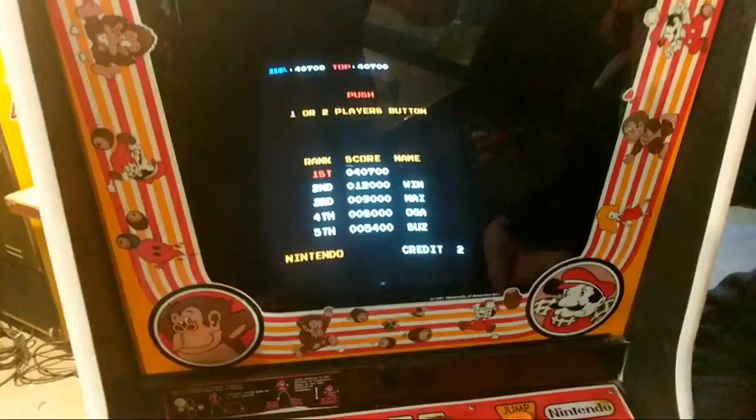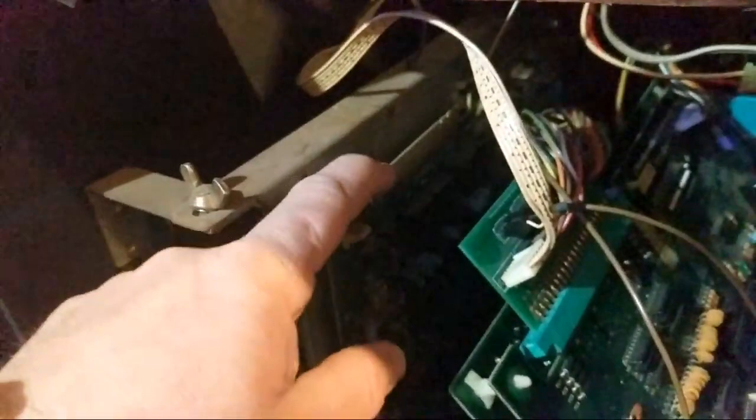There's an adapter so that basically the inside, I'm going to show this because it's good for other people to know. Some, and all of my cabinets are like this, have the individual connectors that connect to the board. So you'll see it doesn't use this edge connector on this cabinet. There's a connector there, and some connectors back here. That's a video connector. There's a power connector back there. And they're all connected to this adapter board, which plugs into the PCB on the edge connector as well. So I can swap these games by just unplugging this and putting it back over here.